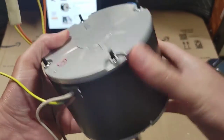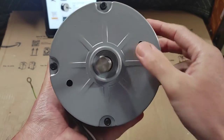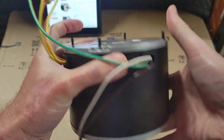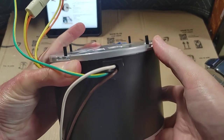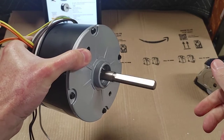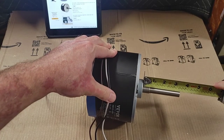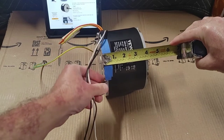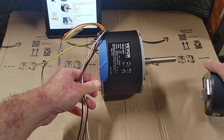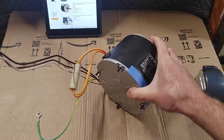This is meant to be mounted like this — there are no plugs up top, and there are holes down here. This is how it came. It has two big drain holes here. The studs weren't dented. It has a nice bearing, and the shaft is three and a quarter inches. It's a 48-frame obviously, with a three and fifteen-sixteenths inch body.